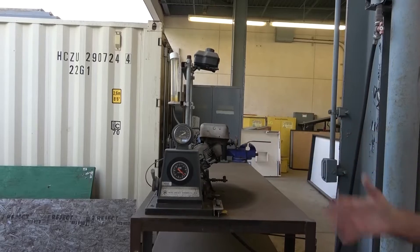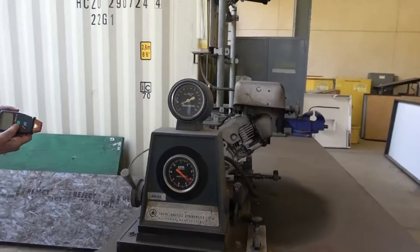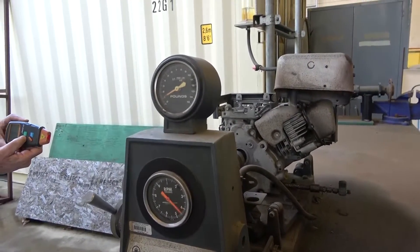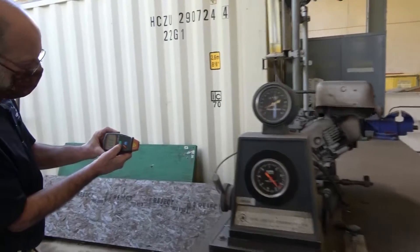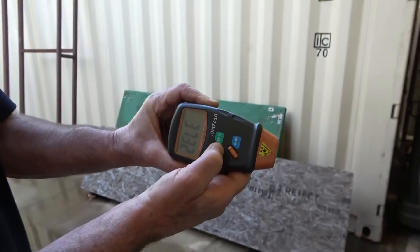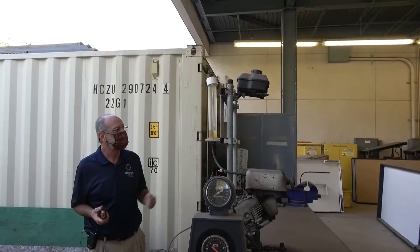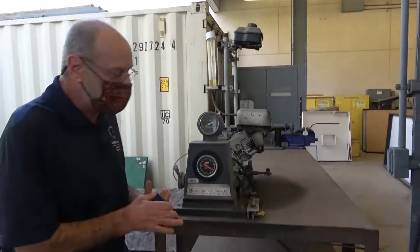You can see how much the tachometer gauge is moving around due to vibration, so I'm going to point the optical tachometer at the magnetic pickup — this gives a much more accurate reading. Then I'll do the fuel flow measuring: I'll take out my stopwatch, watch the cylinder, and 10 cc's later I'll stop it, record all the data, and then increase the load.